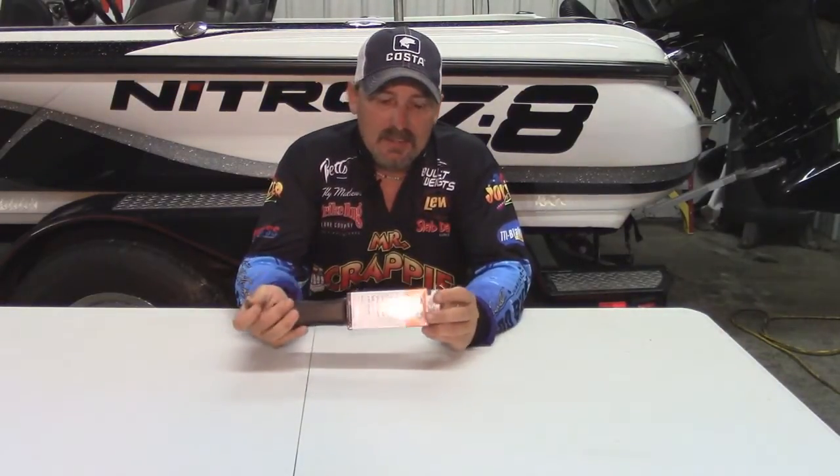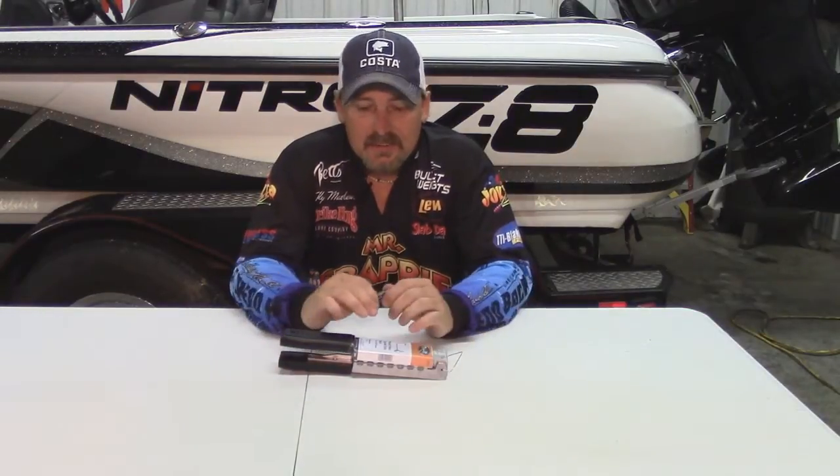Before we do the machining on the mold, I just want to touch a little bit on the correct size for all your jig heads so everybody's on the same page. The correct size for the 1/32nd ounce jig head is 0.97 grams. When we get done with our 1/24th ounce mold, the correct size is 1.28 grams. The correct size on the 1/16th ounce head is 1.94 grams. I think a lot of people that are serious about long line trolling need to get out all of their jig heads and make sure they're dead on what we talked about.